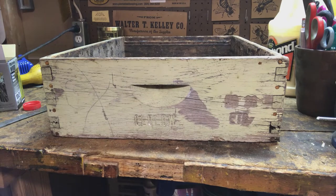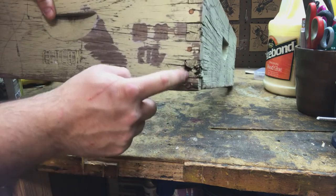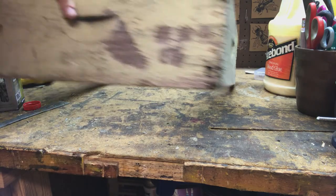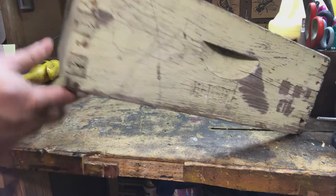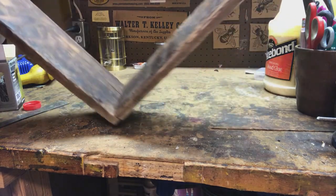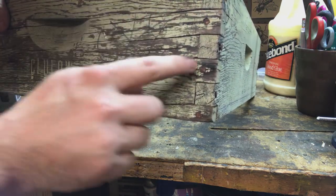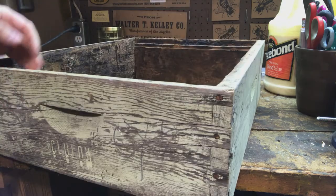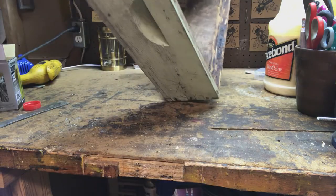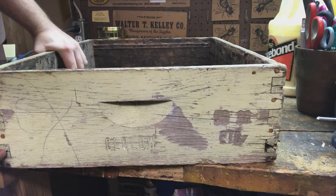And now we're moving to our next box. I'm gonna mix the wood filler at the end so I can get everything. But our main concerns here are, okay, this guy is prone to failing down here because of the missing wood. We have some splits here. The box itself is very wobbly because it's just not sturdy in the joints anymore. So we'll just tighten up with new screws. It's also hard to see on camera, but we have a lot of distinctive cracks that go along here, which might be able to get painted over, but we're gonna put some wood glue in them anyway and see how that goes. The missing joints, however, at least the joints that aren't doing so well, we're gonna put wood filler in those.